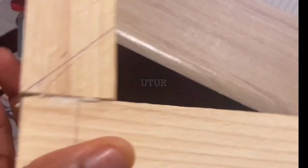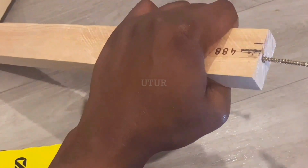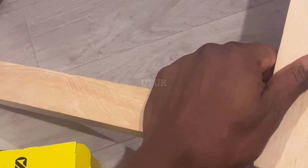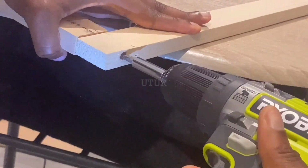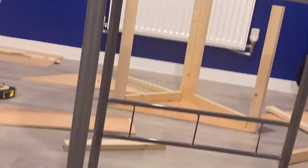In this process step, if you're assembling two pine woods with a larger width, you might as well use a long screw, like the 4 mm screw. But if you're assembling the diagonal cut hardwood plywood onto the pine wood, you need a smaller screw, okay? That's because the hardwood plywood's thickness or depth isn't as thick as that of the two pine woods being assembled together. I'll show you what I mean at a later stage, but at this stage we're going to be using the thin 4 mm diameter and 60 mm long screw to assemble pine woods together.